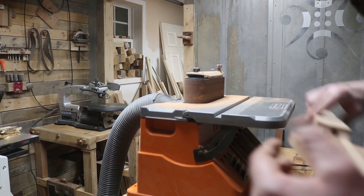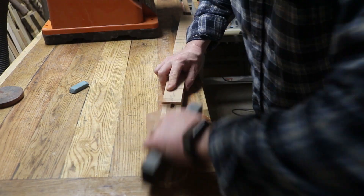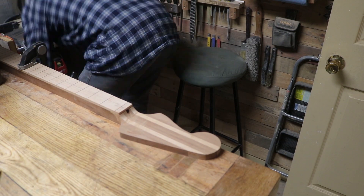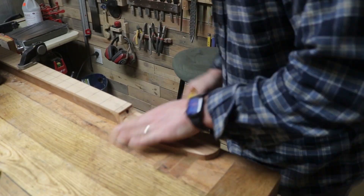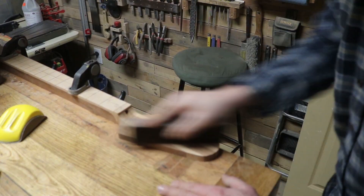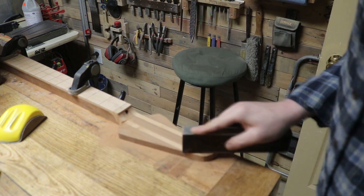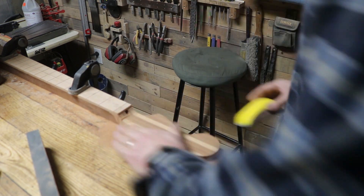Then I start cleaning it up with the leveling beam. The transition from the fretboard to the headstock is really great. I was toying with the idea of cutting in a break angle to the headstock but opted to go flat, having it be a farther distance so the strings break at a steeper angle without having to do a scarf joint or something like that.